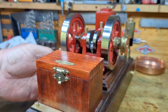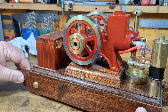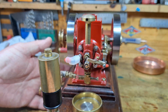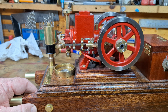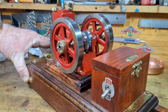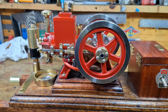It doesn't get run very often, but it's just a beautiful engine. Really happy that started — I think it was the second go. I hope you enjoyed watching this little NJ Moore 6cc hit and miss engine, and those hints about the moose milk and the Zippo with a couple of drops of outboard oil. Also that one blank battery — when I got into hit and miss engines, it was the most common thing I read when googling: to have one blank battery, as it just helps with not getting an overload that shorts out the hall sensor or the electronic components on these little Chinese hit and miss engines. As always, thanks for watching and bye for now.